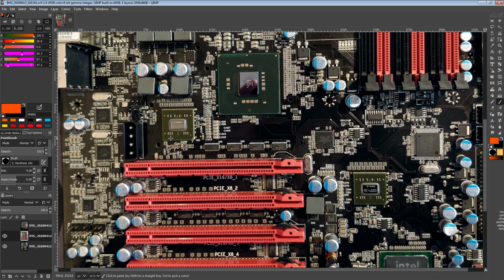Oh yeah, the other thing I want to mention about the NF200. So I know nothing about X58 overclocking, but I've heard this from a lot of people who do know something about X58 overclocking. The NF200s are terrible for X58 overclocking because apparently they don't support very high PCIe clocks, and if my understanding is correct, you need high PCIe clocks to be able to run high BCLK. So if you want to do BCLK overclocking and your motherboard's got a pair of NF200s, or a single NF200 for that matter, it doesn't matter how many there are, as soon as you have one, and if you can't disable it, it's going to screw you over because it doesn't support high PCIe clocks.